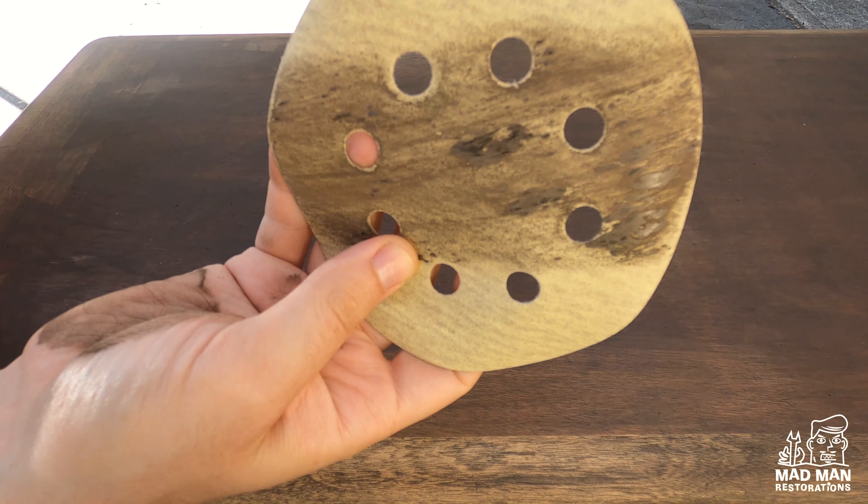You can actually leave the piece as is if you like it — I personally like a very high gloss look, though a lot of people don't. Next we're going to hand rub and wet sand the piece for a very satin finish that looks like it came from the factory. Here are the products I'm going to use: first is 320 grit wet-dry sandpaper, next is regular 0000 steel wool, then Mohawk wool lube rubbing lubricant, and lastly Mohawk pumice stone. You definitely don't need a large container — a small amount is plenty.